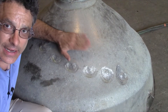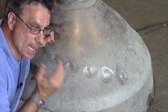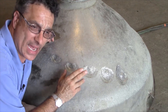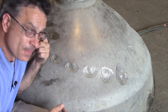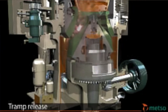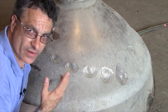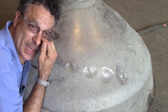What we're looking at here on the outside is the mantle, and as the mantle got dinged, most of the force appears to have been taken up by the backing behind the mantle. The backing is what sits between the mantle and the head inside. We have examined the entire crusher and it looks like the backing is what took up most of the force that could not be taken up by the tramp iron relief system — so what's inside the backing is what took up a lot of that crushing force.